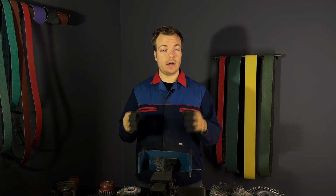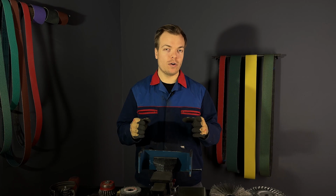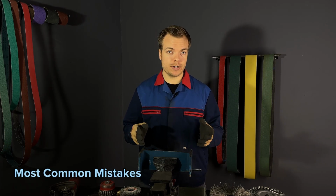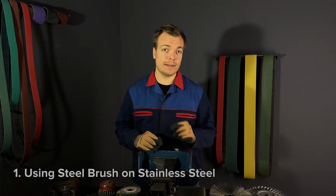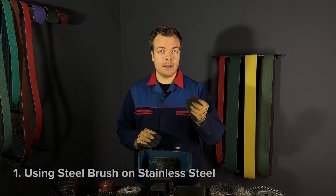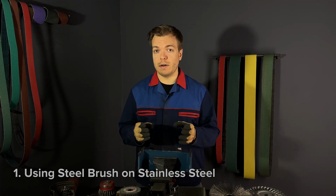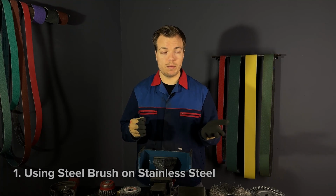Let's move on to the next topic of the video. In the next section, we'll have a look at the most common mistakes our customers make when using wire brushes. First mistake is using steel wire brush on stainless steel surface. The steel wire brush will contaminate your stainless steel surface and eventually it will rust. When you're working with stainless steel, use stainless steel wire brushes or brass wire brushes.